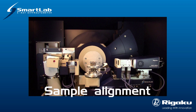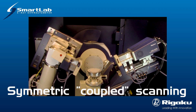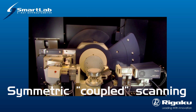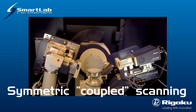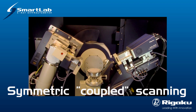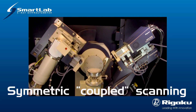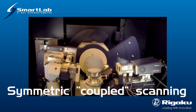The system is now ready to make a wide variety of measurement types, depending on sample characteristics. Symmetric or coupled measurements determine the periodicities in the sample that exist perpendicular to the sample surface. This geometry moves the source and detector simultaneously in a coupled manner. Use of this geometry with the focusing X-ray beam provided by CBO creates the Bragg-Brentano powder diffraction scan familiar to many users.